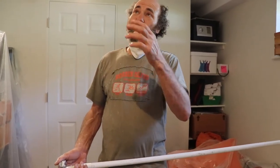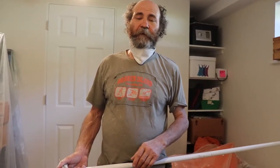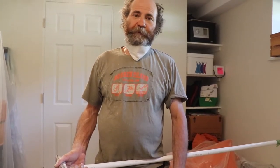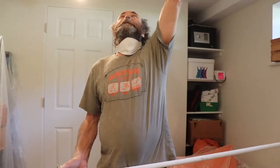For the ceiling, in this case here we're just doing the patch. I'm gonna go first over close to the board where the new mud meets the old one — that one I have to sand really good. The rest I'm just gonna remove the ridge and make it smooth. The part where somebody comes and takes a look is where the new mud meets the old one, and that's where you have to do your extra job. Check with the light and a sponge because sometimes there are a few things behind, and if you're not happy with it you can put a little more mud, sand it, or apply the primer and check again and do some touch-up.